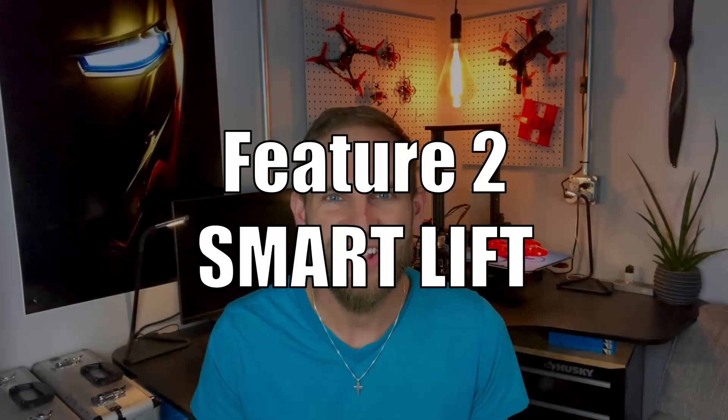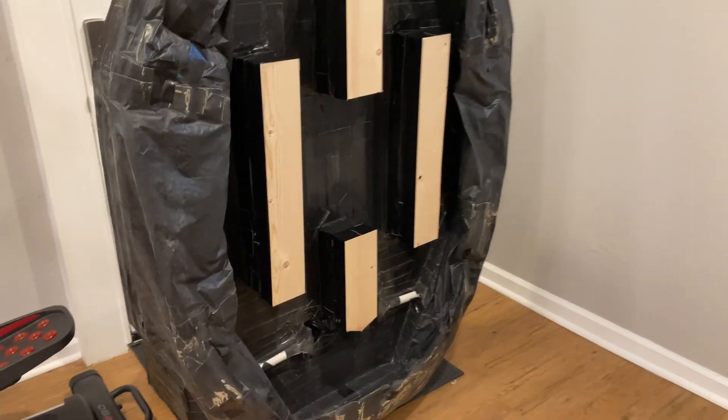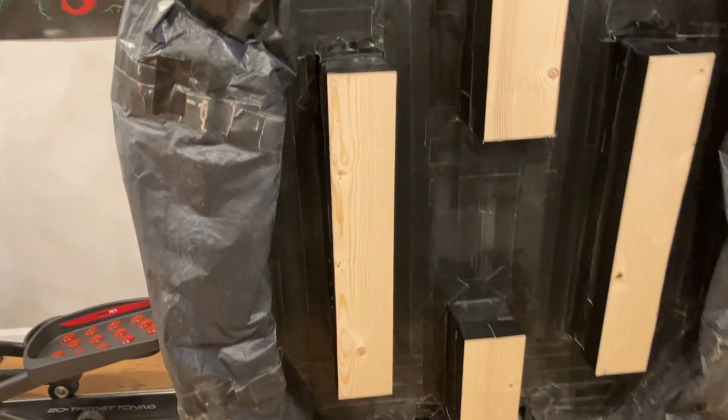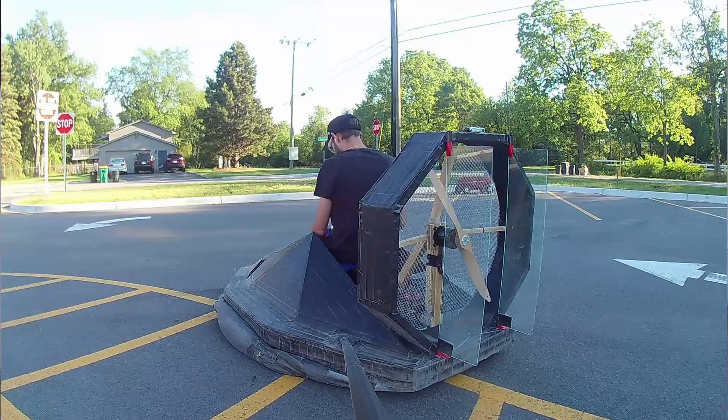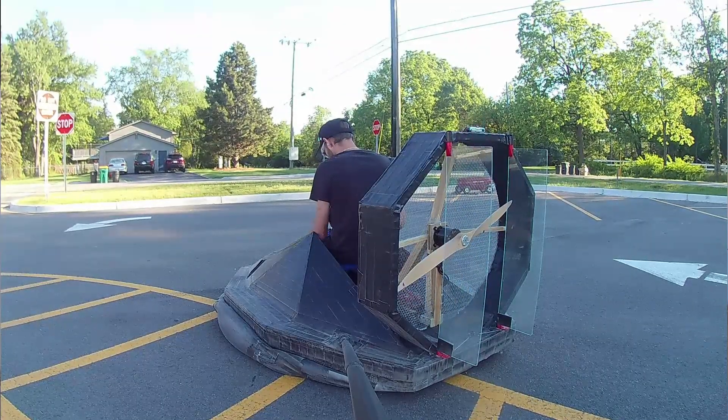Secondly, the main smart feature we need for an electric hovercraft is the ability to start and stop quickly. We've already put skids in the bottom of the hovercraft, allowing it to brake when the skirt is deflated. The key is to be able to quickly deflate and then reinflate the skirt to get going in a new direction. For stopping, we've implemented a smart deflation feature that idles the motor at just the right speed to keep it deflated but ready for quickly reinflating when the command is given.